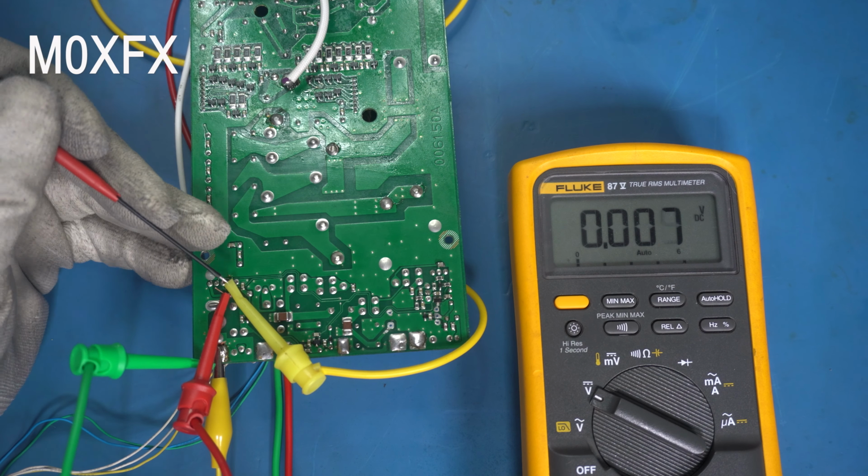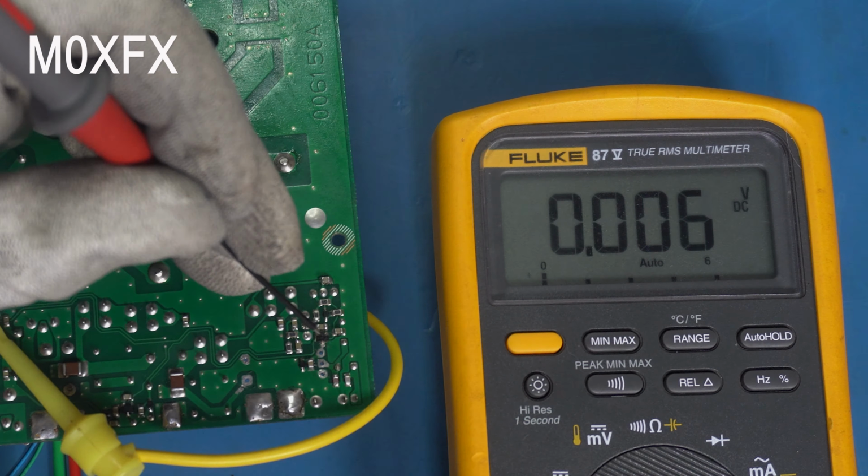So if we now switch on the TX8, you can see here, yeah, we've got 8 volts there. And if we look at the base of this transistor, that's gone high. As that goes high, this is a PNP device, this should switch off. And it's not. Now, before we were getting 1.4 volts or thereabouts, that's when the relay was actually in there. So I'll just say this thing's shot, and that's the reason it's different now, it's just a consequence of the loading effect of the coil. So we need to change this transistor.